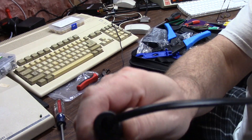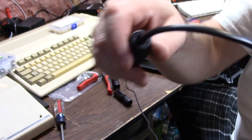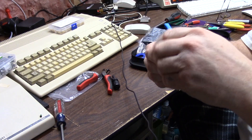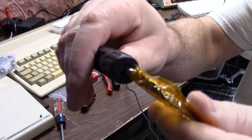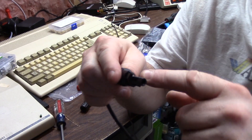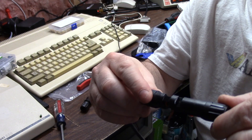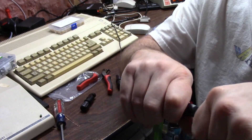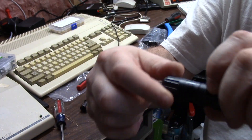When you're fully completed they'll look like this — these are mine. You can look at the cable on the side and see those little dots — that is all of these fingers crushed around the cable forming a good seal. Then you have the silicone ring as your actual weather pack, and there's also another O-ring at the top. Where this inserts into the positive, when you click-lock them it is sealed against weather at multiple points, and you can give them a good tug — they're not coming apart.